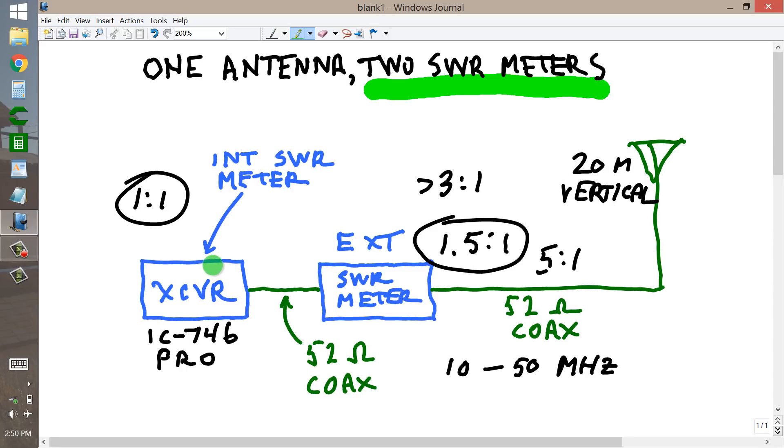80, 60, 40, and 160 meters are out of the question with this antenna. I run 10 watts CW, 7 watts PSK-31. I'm a sort of quasi or near-QRP operator — true QRP calls for 5 watts output or less, but it's pretty close. I've never had any complaints from neighbors, as I've explained in other videos, and never had any RFI to any of my home appliances either.